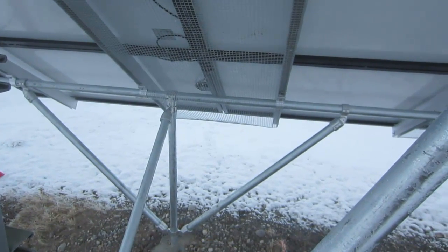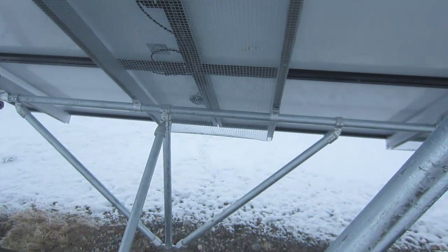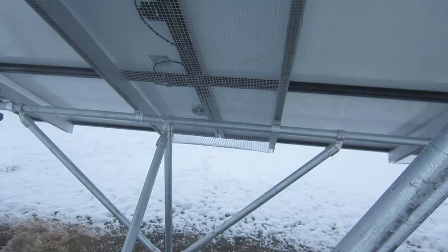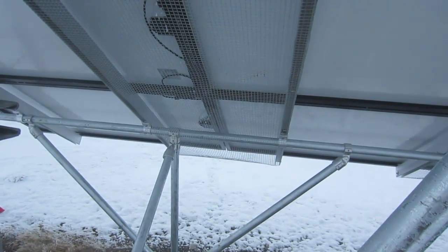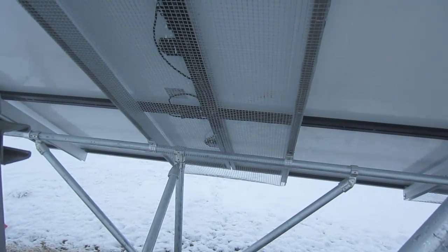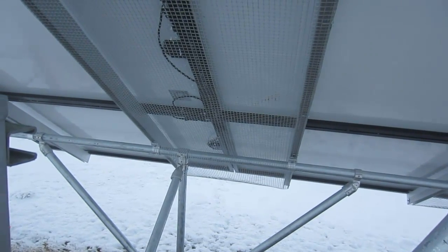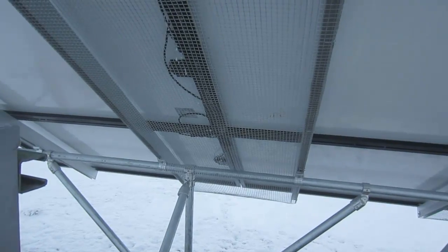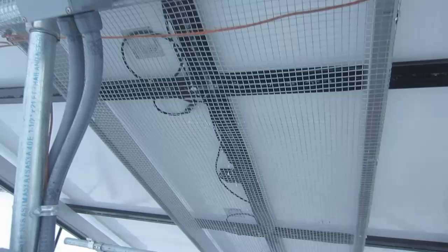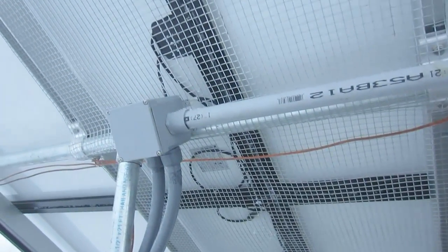Another concern is electrical shock. When the county inspector was inspecting this array, he actually reached in as far as he could to see if he could touch the electrical connections from the panels — he could not. They explained that this needs to be, quote, child-proof, so children cannot reach in and touch those terminals. As you can see, per code, they have a wire mesh over all the electrical connections here, and all the connections are sealed.